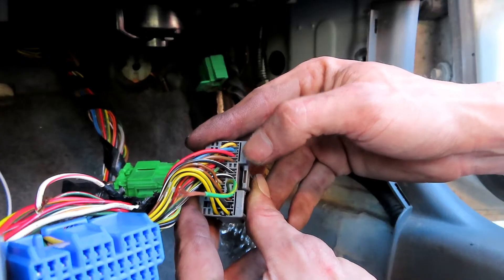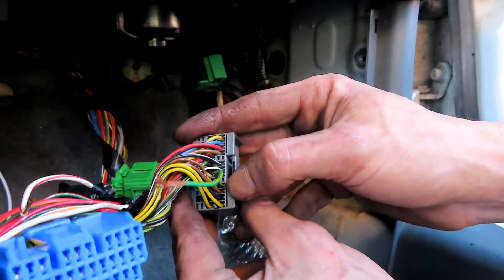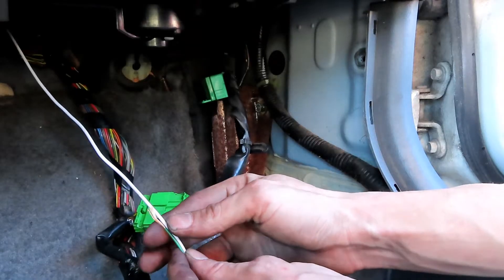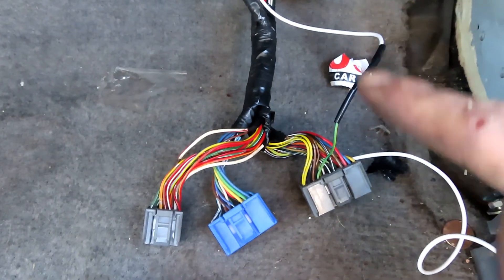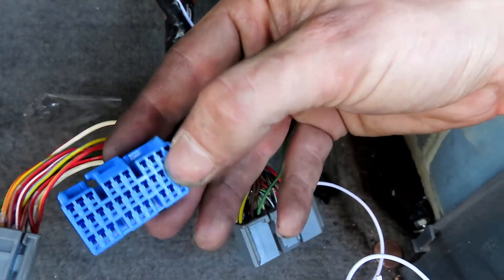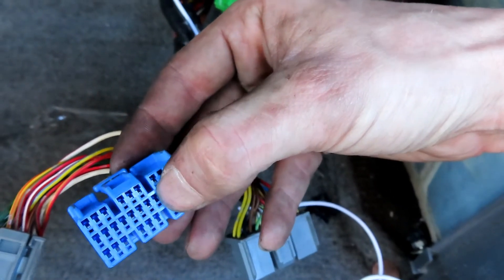Blue, red, and brown - those are all going to be the same solid colors. So your VTEC is going to be on the opposing side, right there at the top. Once you've got that in, go ahead and wire it in. We got that wired in - now if you go ahead and hook the ECU in and drive the car, as long as it is a VTEC ECU, your VTEC will engage. Now for the pressure switch, if you guys do want to add that in, the car will have to warm up, get to the right pressure, and then that switch will activate. This is going to be C15.